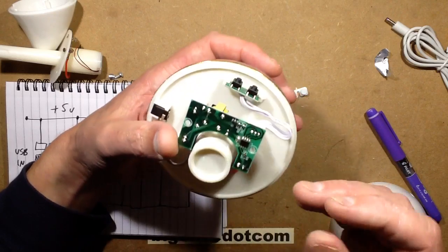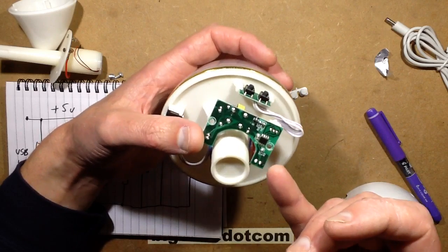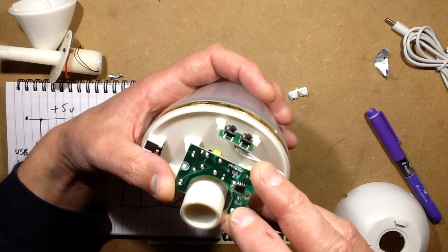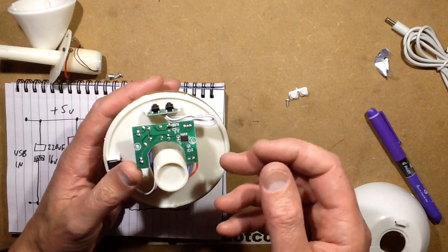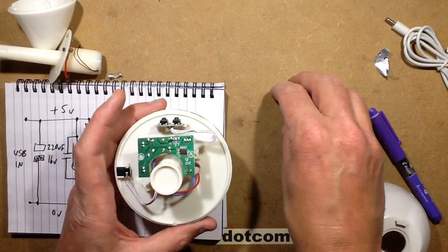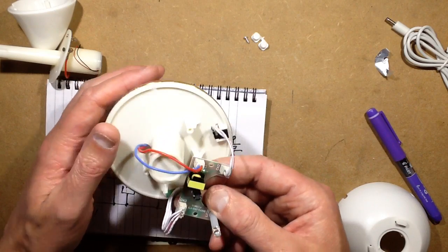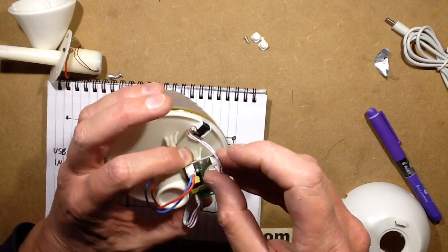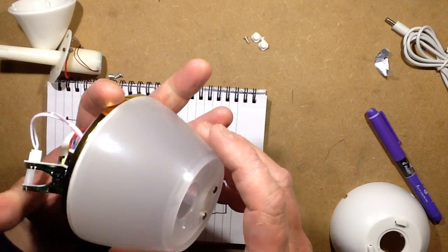I've drawn out the circuit. It uses an anonymous PIC-like chip — an eight-pin processor, a little microcontroller, and it's not marked. How do they keep track of these? They must be bulk-programmed and loaded into the pick-and-place surface mount machine with the labeling on the tube itself. The circuit board has a three-pin connector for the push buttons, a two-pin connector for the power in, and a two-pin connector with silicone leads going out to the connectors for the piezoelectric transducer.